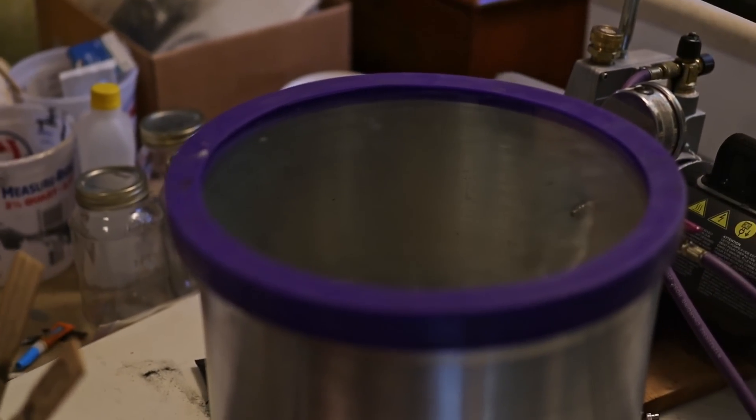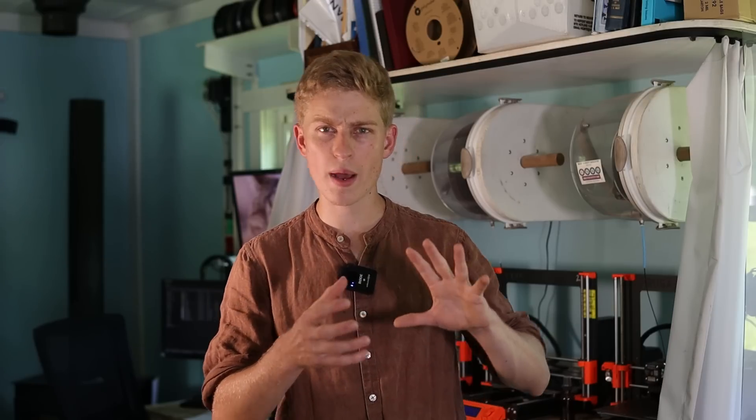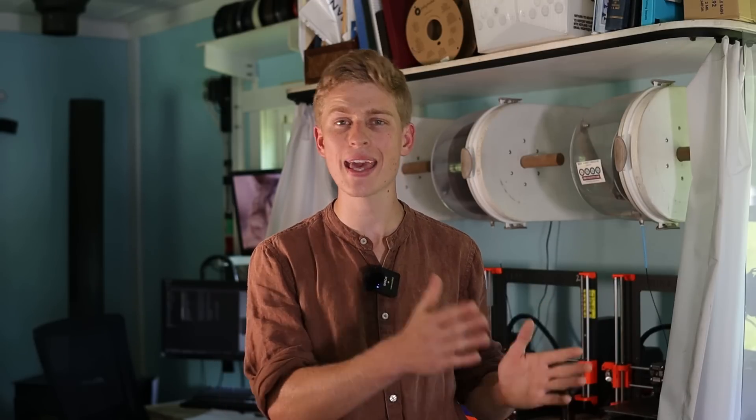What I also do is take the filament after it's run through my dryer — nice and hot — and then put it in a vacuum chamber for around 12 hours or even longer if I have time. That's something Vision Miner recommended for their drying process and I thought I'd try it. It actually helps — I get better results with shorter drying periods. The filament stays hot in the vacuum chamber for some time because vacuum is quite insulating, and after actively heating up it seems to break the water molecules loose from the polymer and allows them to dry out more quickly. That's not 100% a requirement, but if you have a vacuum chamber it does speed the process up quite a bit.